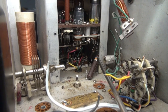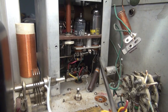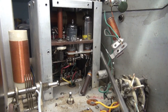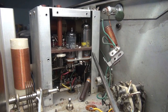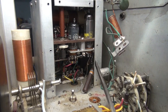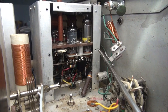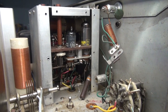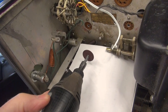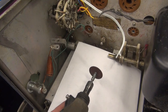The reason this has probably happened is this is a very difficult area to work in. This is your voltage regulator tube, and this resistor goes to a pin that's all the way up there, then it's soldered down here to the terminal board. When they built this, obviously this cage wasn't in the way so they had access. But unless you want to pull the front panel off your Ranger and pull this cage, there's only one good way to access this. If you can't get your iron in there, you can't get your pliers in there — the best thing to do is come over here and put a notch in the aluminum to allow access to that pin. When you put the cover back on, you'll never see the notch. So I'm going to take my Dremel with a cutoff wheel, protect this area so nothing falls in, slice and dice the aluminum, and make myself a little access slot.